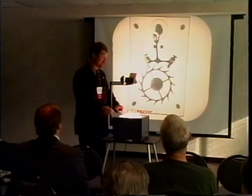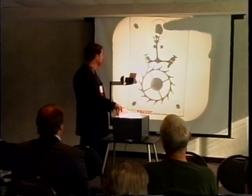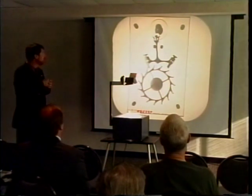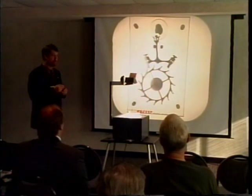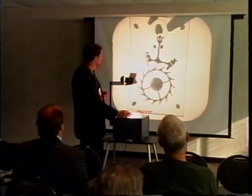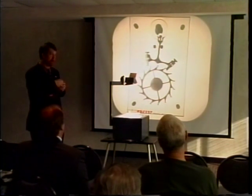And the way that is measured is from the moment the roller jewel contacts the edge of the fork slot, you draw a line from, let me think now, it's been a while since I talked about this, from the roller center through that intersection, okay? So it would be from the roller center through this point right here, and a line would come down. Correct me if I'm wrong, because I'm thinking while I'm talking here. Then the impulse or unlocking impulse would take place, and in the moment it lets off, you draw another line from the roller center through the roller jewel, like that, and that angle is your lift angle. That's correct?